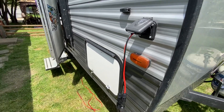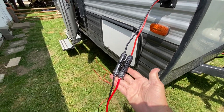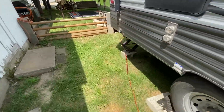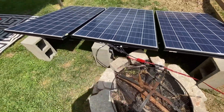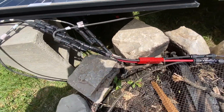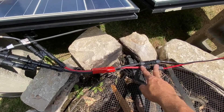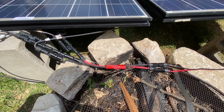For the connection, I picked up the Furion adapter with MC4 connectors, made a nice long PV cable, and that travels over to the solar panels. Because I have them in parallel, I used MC4 branch connectors, and then made an adapter with MC4 branch connectors and an Anderson plug to make it easy to disconnect and reconnect. That goes into more MC4 connectors — this way I didn't have to cut up wire in case I needed to use them for something else.